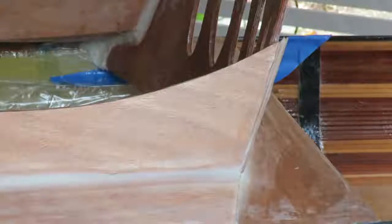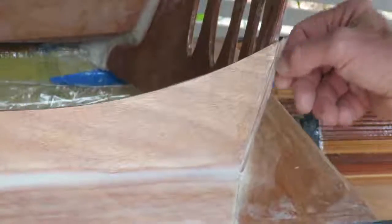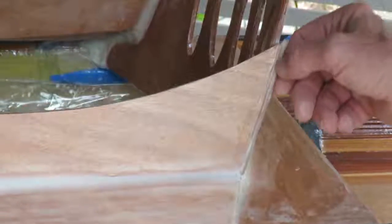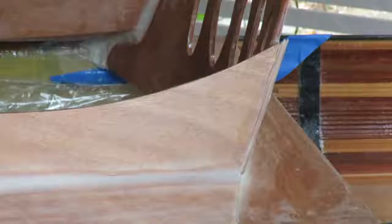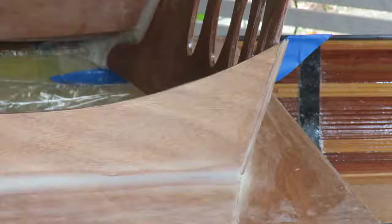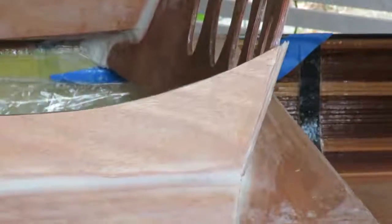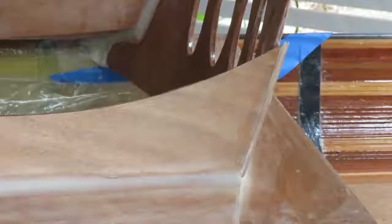Okay, and if you're using the Dremel wheel, this is silica dust that you're cutting into, so that you'll be putting up in the air. So it's good to wear a dust mask. So I'll get my dust mask on, and here we go. Safety glasses, of course, and I've got hearing protectors on too.